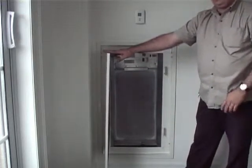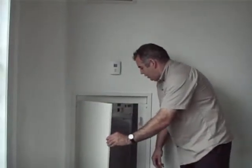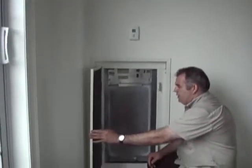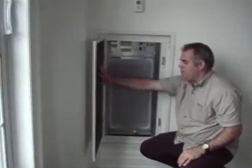Place it down on the bottom, push down a little bit so it fits inside the sleeve, and then your filter's been changed. A quick tip that may really help your cleaners or even yourself keep your apartment from getting dusty: when you open up your heat pump chassis at the front, it has a baffle — it's a black matting material.